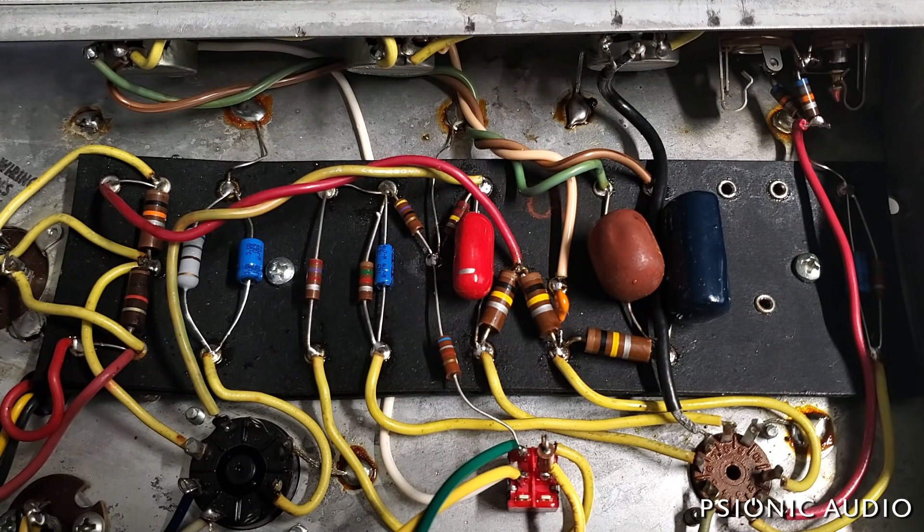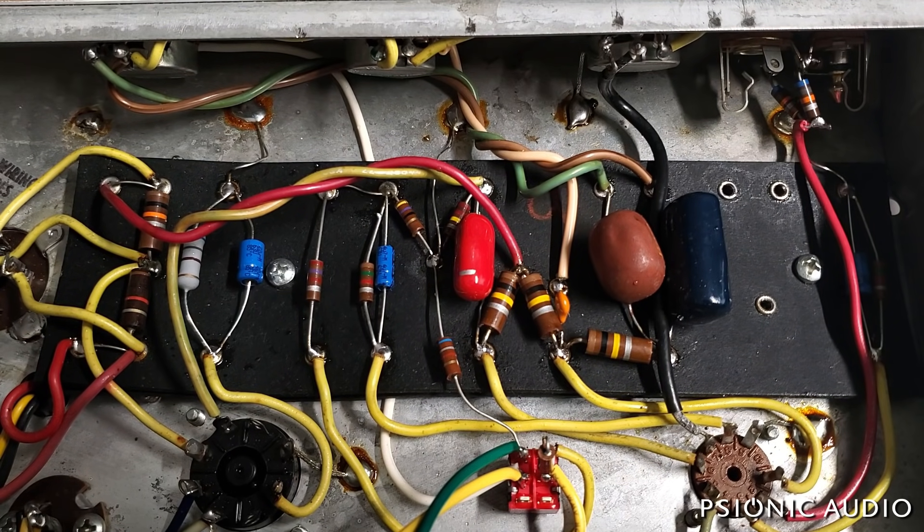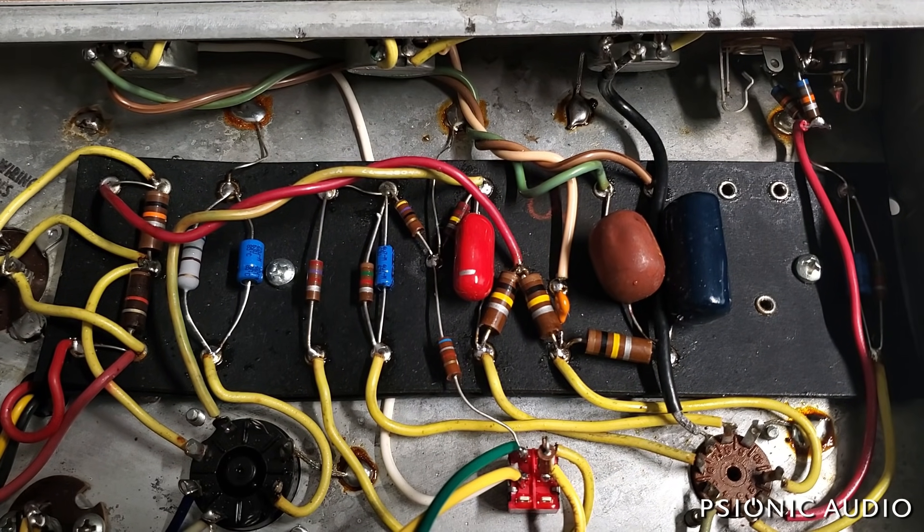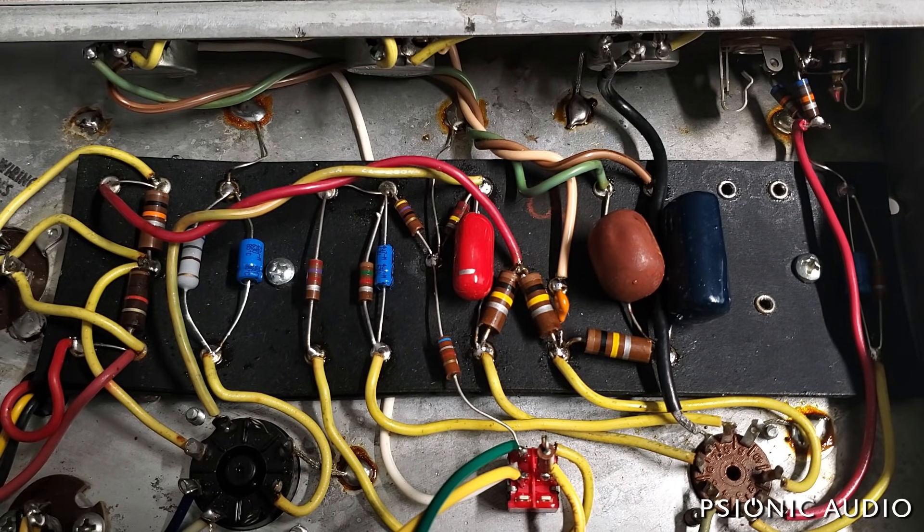Not only is it no longer furry, but it has really nice note separation and clarity. I disconnected the negative feedback and I was getting a little bit of ghost noting, which may be a cool thing for harmonica, but I thought it was a little bit over the top. So instead of fully disconnecting the negative feedback, I'm just changing the value of it — there's a lot less, but it doesn't go away entirely, and the output section doesn't have the ghost noting.